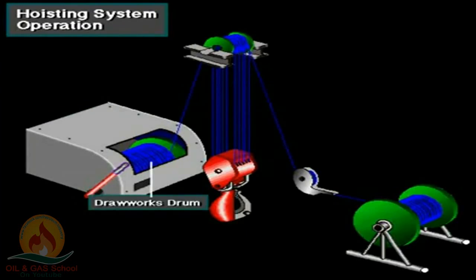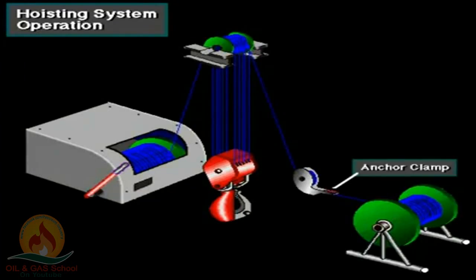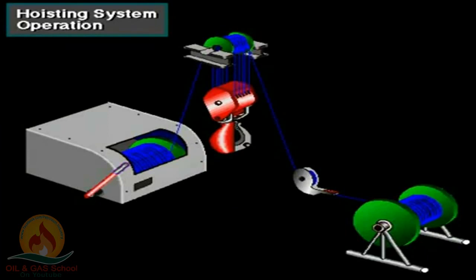The driller then takes in the drilling line, which wraps around the drum. The driller usually takes in enough line so that the line makes at least 6 wraps around the drum. They then clamp the line at the deadline anchor. As the driller activates the Drawworks to take in line, the traveling block moves up. The driller uses the brake to stop the traveling block at any position.